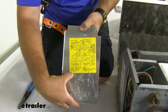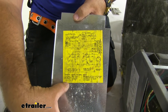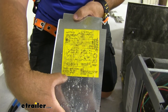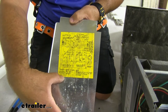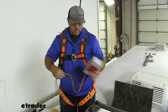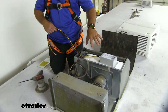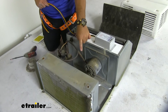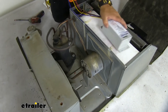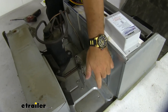In the bottom corner there's going to be a number — you want to notate that number. This is going to be the number you use for your specific air conditioner for the wiring schematics, because there are so many different models that wire different ways. You want to make sure you're wiring it the correct way for yours. Next, we need to determine where we're going to mount our soft start. Our wires have to come in through this grommet into this area right here. We're going to mount it down in here, but we want to make sure we're staying away from our fan so when our fan runs, it doesn't damage it.